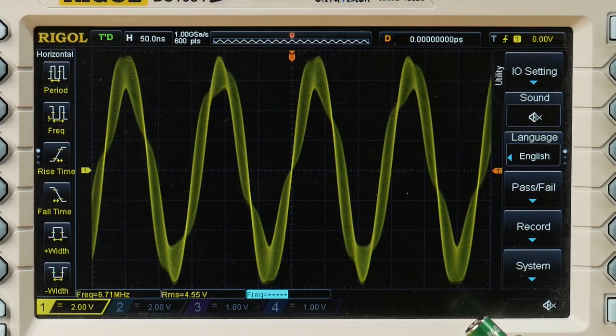Because one of the issues that's going to happen when we try and connect this to a real input device to try and capture something real, for example, some RF signal, is that if we have an input circuit that's producing some noise mixed in with a signal that we care about, not only will we see the noise going from 0 to 16 megahertz, but we'll also see the noise going from 16 megahertz way up through the spectrum, which is going to be a major problem.